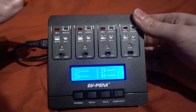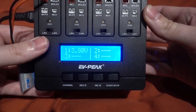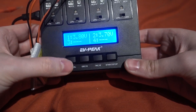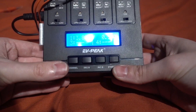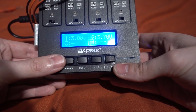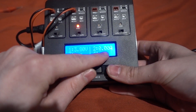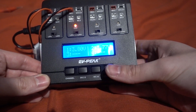Once you've selected your settings, you plug your battery in. I've got a discharged battery here — that just goes in the top like that, and instantly it shows me the voltage: 3.79 to 3.8 volts. I can plug more in and do up to four at a time. I can go into the channel and increase that also to 0.5 amps. Then a long press of the start/stop button starts charging — it lights up and starts charging, maxing out at 0.5 amps.